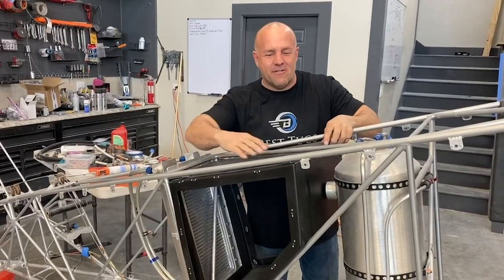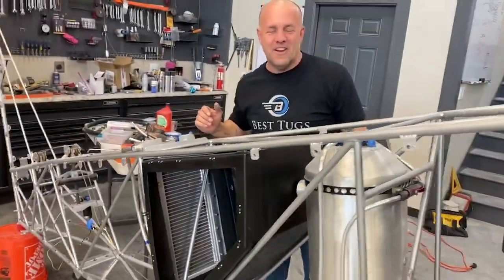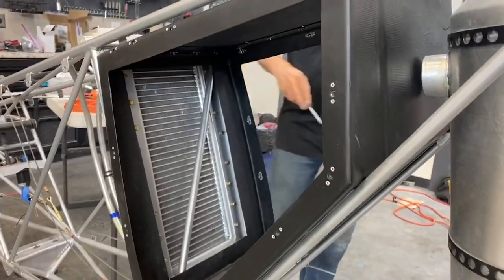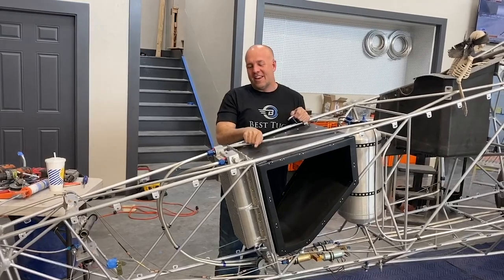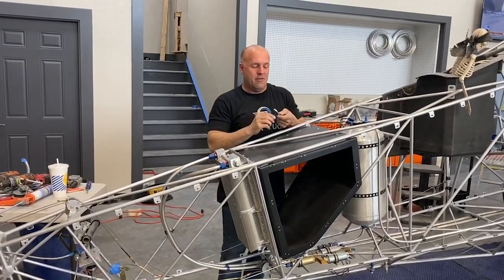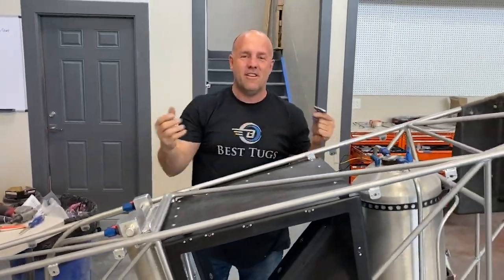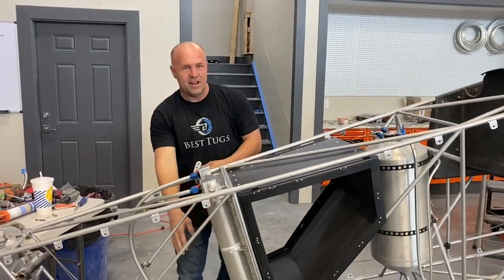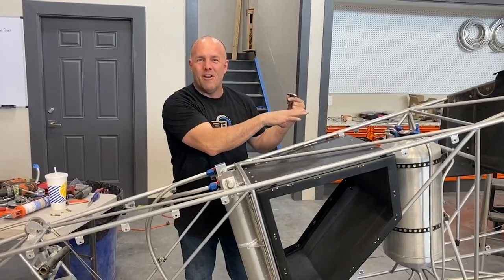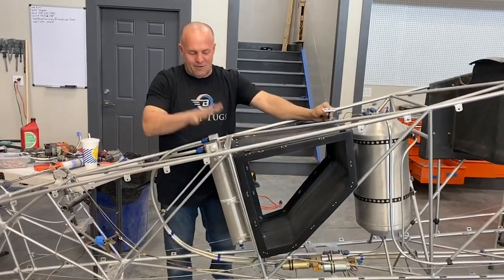It's so easy to get to this point, it goes so fast. Here's my pressurized top for the airbox. I've got the top down. Now every single connection on this airbox through the oil cooler, I'm using a gasket sealer so it's air tight — the only air that can get in can only go out through the oil cooler. I machined this little teeny bracket — you can see I lightened it up. This is going in the bottom. I just drilled these holes through here. This port goes down here — this is just a drain. So if I go through a rainstorm, there'll be a ton of water funneling into here. Usually in a cowling it just drains out the bottom of the cowling — I don't want it draining into the belly of the plane and working its way into my belly pod where I'll have my sleeping bag. So the drain is going on the bottom, and then I'm done with this. The last closeout is the fuselage, and this box and oil cooler are complete.